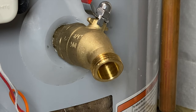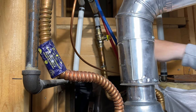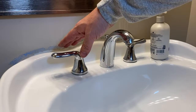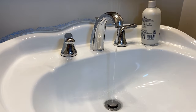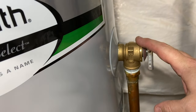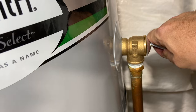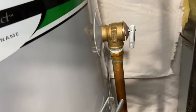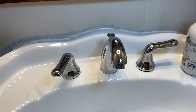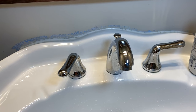We're going to fill this bad boy back up. We'll open our water valve again and just crack it a little, get the tank filling up. We're going to open up the hot side faucet and just let it stay open to let air escape from the system. While your tank is filling up, you want to relieve some pressure — just go to the T&P valve and pop it open. You can hear the air coming out and then the water starts coming faster. Do that once in a while and it helps fill the tank quicker. Now you can see all the air is getting blown out of the line and it's getting very close to water.